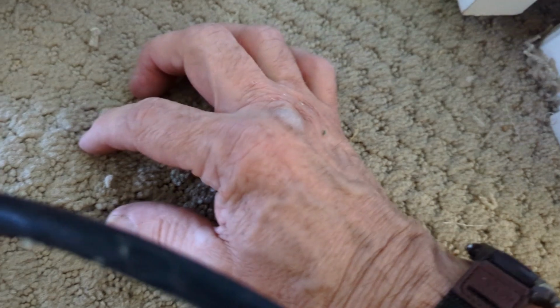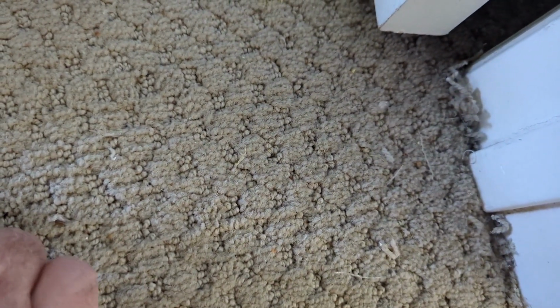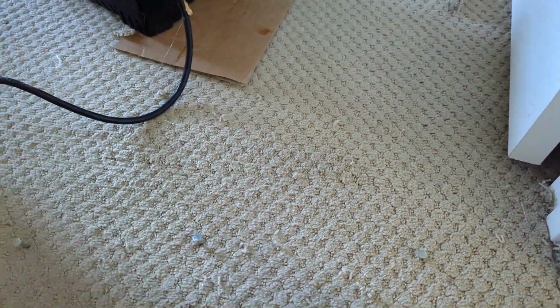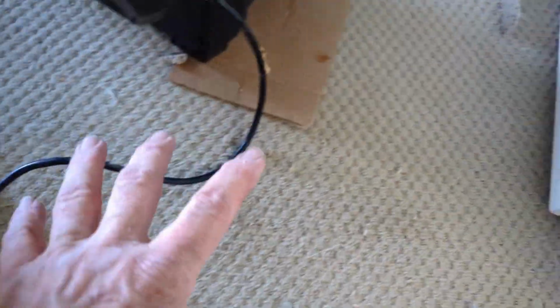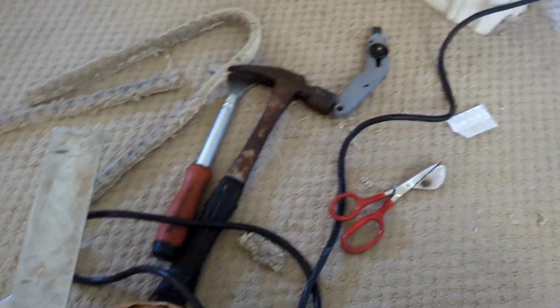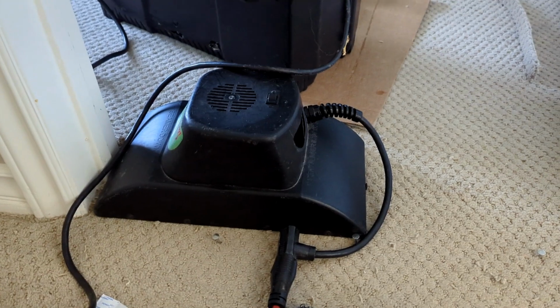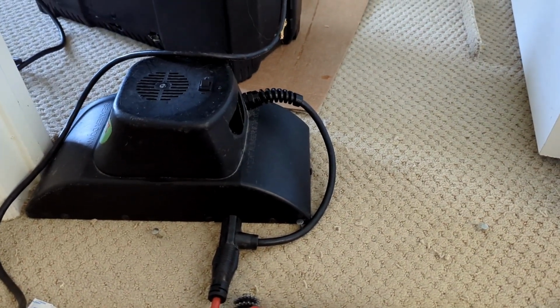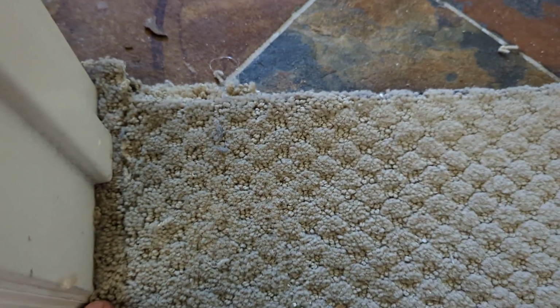Here you have me seaming it, and look how nice that's coming out, by the way, and the pattern is perfect. I always pinch it as I'm pushing it along, just with my fingertips, so it keeps it nice and tight. All right, and then once you've taken your seaming iron out, it's still hot, and there's a potential for it to separate. So you use these suction slash weights. They're fan based, and they actually pull the tape into the backing, which makes it stronger.